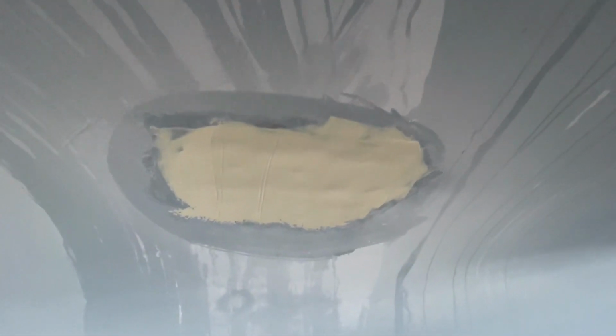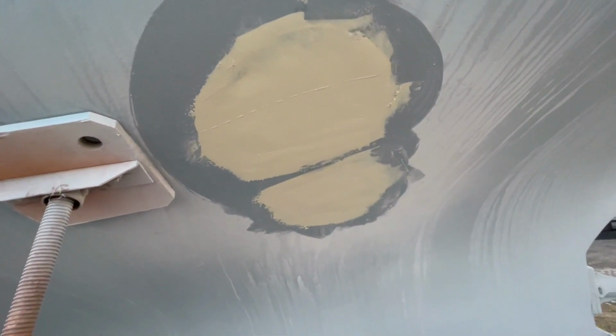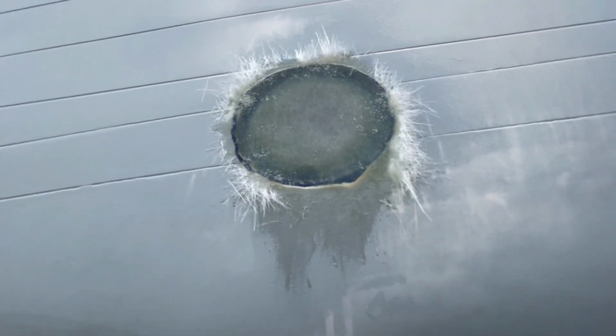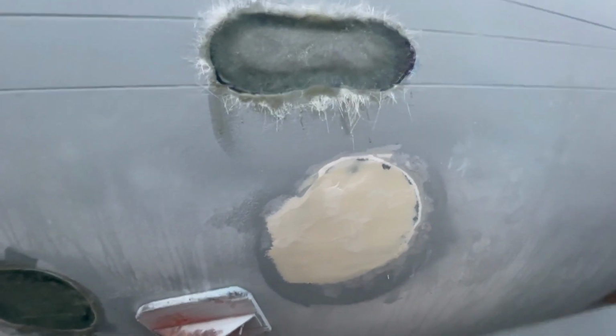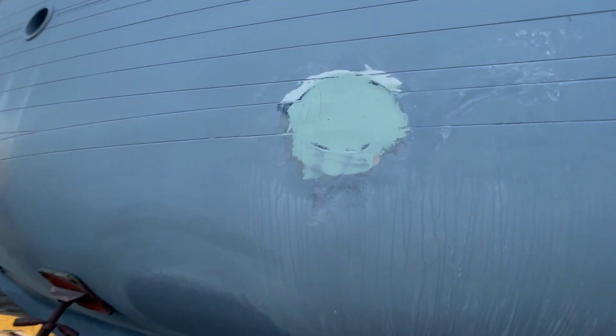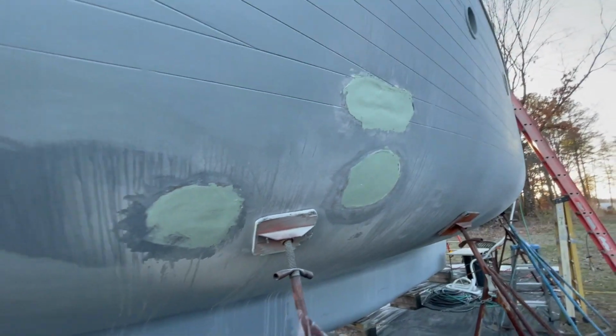The concave areas are filled in with several layers of concentric circles of 1708 fiberglass mat bound to Stratego and each other with vinyl ester resin. You can see the fiberglass mat on the edges of the patch before the filler. Once the patches are done, they were ready for the fairing compound, in this case 3M premium filler.